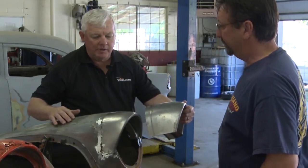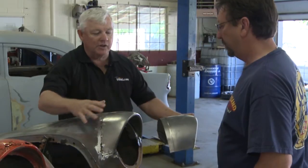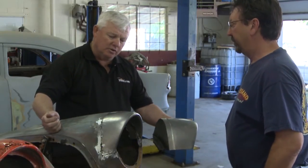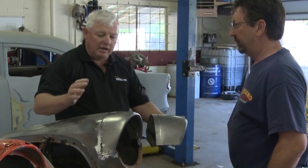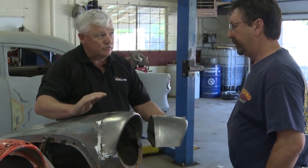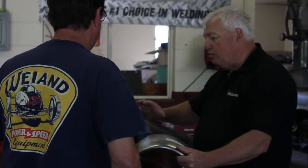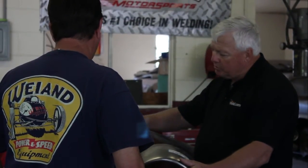We've got a couple of MIG tacks and a couple of TIG tacks on here, but we're eventually going to tack weld this a bit more and cold work it while I tack. There's going to be a significant number of tacks on this. I'll set up the TIG machine and take your cue — I'll make a tack wherever you want and check the mismatch. When this thing is finished it'll be riddled with tacks, we'll give it a last review, let you do any cold working you want, and then I'll go into a complete weld.